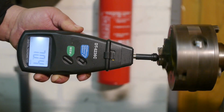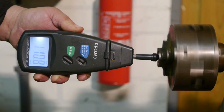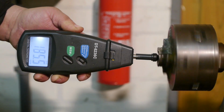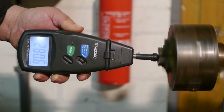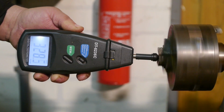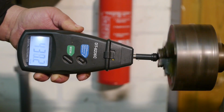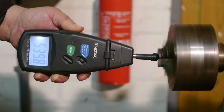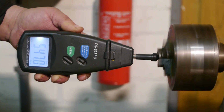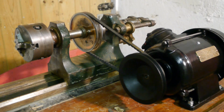As you can see, I have mounted a VFD drive, and that gives me a nice speed range up to a maximum of about 650 RPM, and I don't think I should go any faster with these type of bearings. I mounted the motor directly to the board. There's no way to adjust the belt tension.